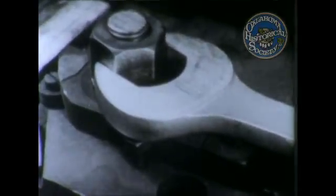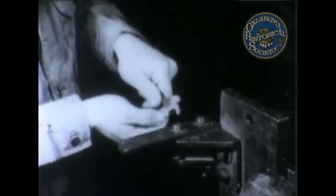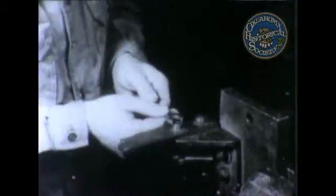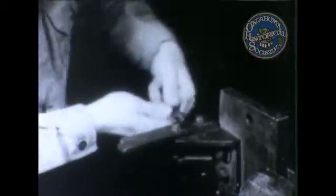Wait a minute. See that there isn't an empty box, a pile of rope, or some other hazard that you will trip over if the wrench should slip and you lose your balance. Another thing, you are not placing the wrench properly. If a wrench is not seated properly or is too large for the nut, the jaws may be broken when pressure is applied, as all the strain is placed on the tips of the jaws, which are the weakest points in the wrench.